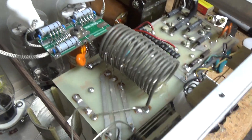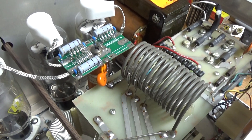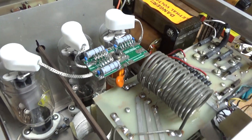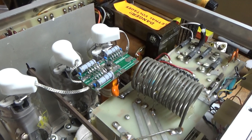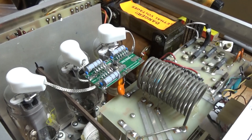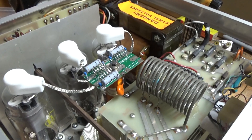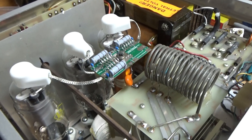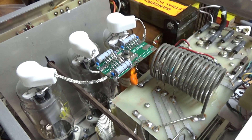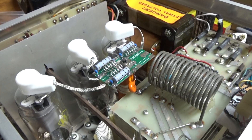Did the bias modification. Added the diodes to the rear board to set the static plate current. The older ones have no diodes, so the tubes end up biased on harder — they pull more static plate current, which creates more instability, runs the tubes hotter, and pulls more current from the wall, wasting power. That's why they switched over in the newer ones, and I always add it in the older ones. Especially the 4-tuber — if you have a 4-tuber where the grids are not grounded, where you have 51 or 52 ohm resistors between the grid and ground, you always want to add those diodes. It's really important.